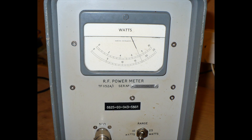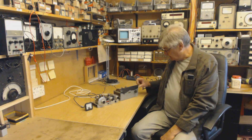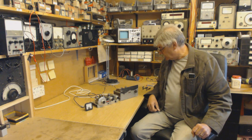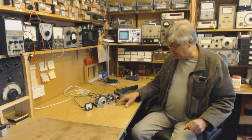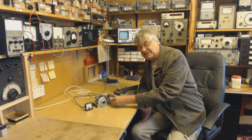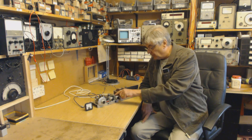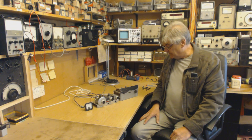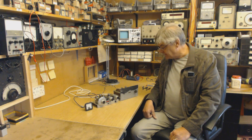I'm quite pleased with that. Unfortunately as I say, someone's put black paint on here. I think there was a switch there. I'll try to put it back as it was and I'll probably have a go with it on the 160 meter amateur band and perhaps 80 meters. The two variable capacitors — I don't know what's happened, they've been bashed. They short out but I think I've got the identical types. You can't straighten them but it didn't affect the tuning up or the loading.